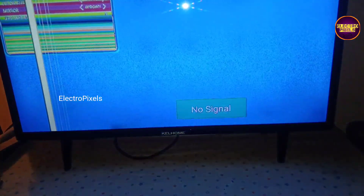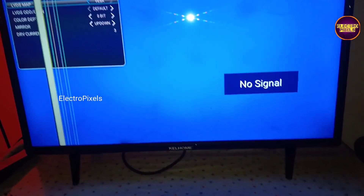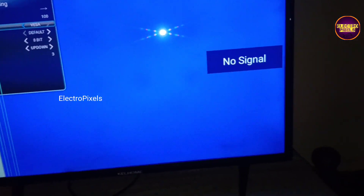Now the picture is clear. You can notice vertical bars on the display — this is because of COF damage, which can be repaired in a panel bonding machine.